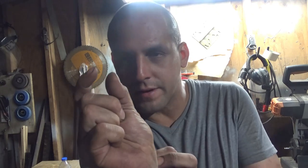Before, I tried everything. I ran my gas anywhere from 10 CFH all the way up to 30 with that small cup. No real differences. I'd try to go super fast as possible. If I welded maybe a very tiny amount with a little cup, I could probably get some decent color. But for the most part, you see my welds, I was having a lot of trouble with it, and that was an instant improvement.